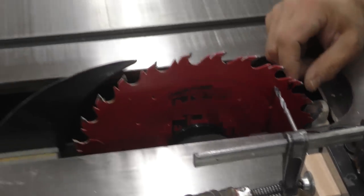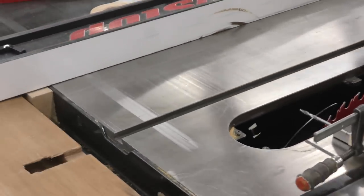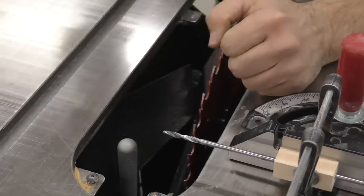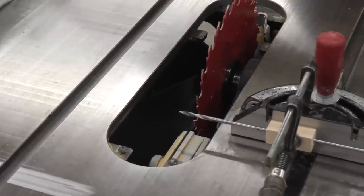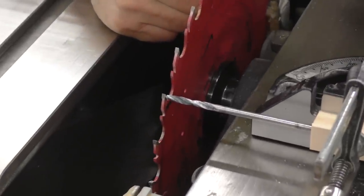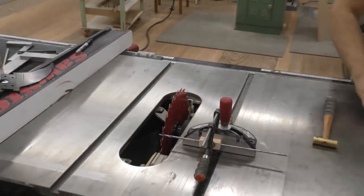I don't think I can go over there without moving things, so I'm going to drop this down, slide this over, move this around. I want to be able to get as far away from the two points as possible so I can be more accurate. This is why you can't have any slop in your miter gauge. Okay, just touching. This is right on — these slots are parallel to this blade.